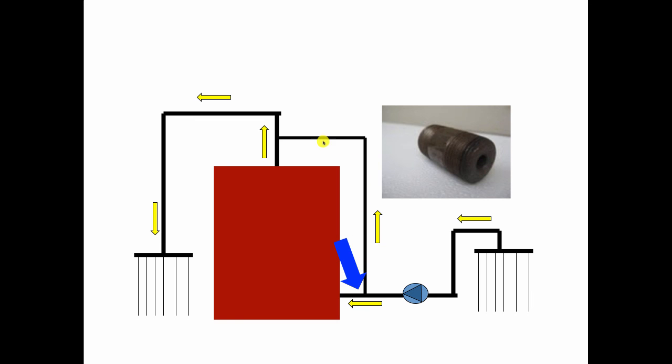And Mr. Jelinek figured out that set up this way, if you maintained 180-degree water on the boiler, you would get 140-degree water going out to the tubing, which would give you 50 BTUs per square foot in the Levitt house, which seems like a lot by today's standards, but keep in mind it's the 50s and 60s and people like to put down rugs, even shag rugs, and they needed to push the heat through that. So that's the way it worked.